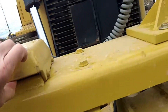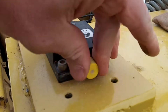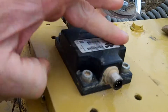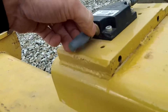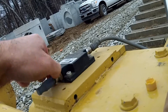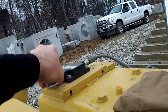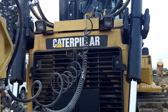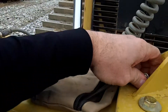They just installed it themselves — that's awesome. So the first thing I want to do is take a look at this sensor. It probably should have a terminator on here, otherwise it will have issues. A 50-ohm terminator on the TSI-3 — basically it tells the system which direction to go, like a diode. Without it, the system could get confused and potentially give you that error message. If this is all the system needs, these guys did an outstanding job installing — this looks really good.